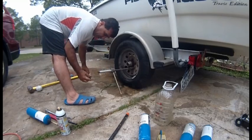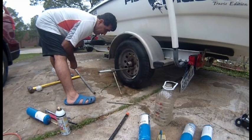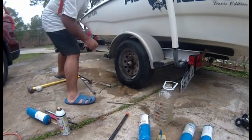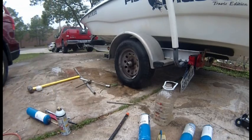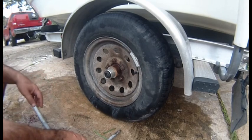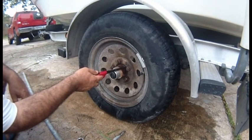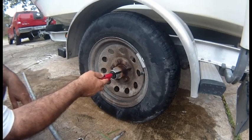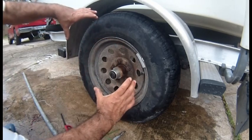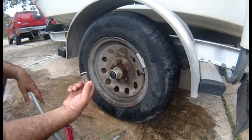Well, we broke this — that's what we managed to do. The trick that worked best was to get the nut hot for about three minutes, and then while it's hot — because it gets bigger — move it. And it moved like butter. I learned something myself, I guess.